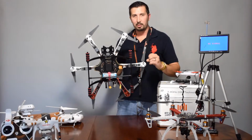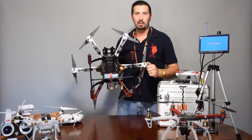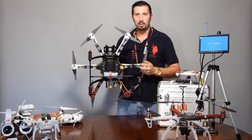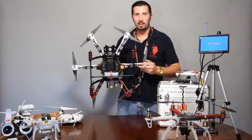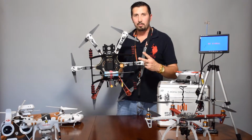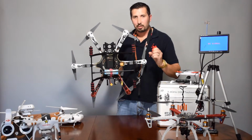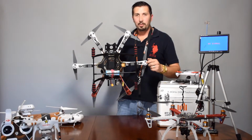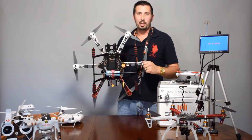and know when you first see it flashing red, get that sucker back, get it on the ground, because it will go into that auto land sequence, and it doesn't know where it's at, but it just wants to get down safely. So again, when it's running, you have 2 levels of low voltage. You'll see it start to flash red, just red in succession, and know that you've hit your first level. Get it back. You've got about a minute of flight time left.